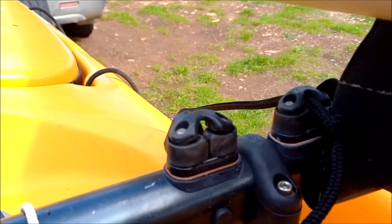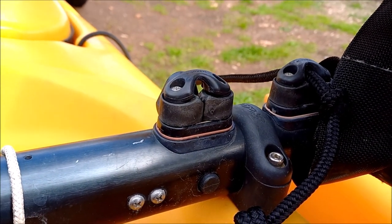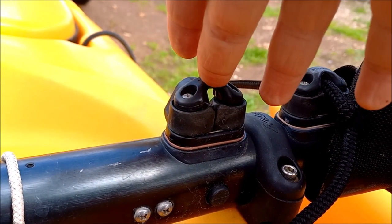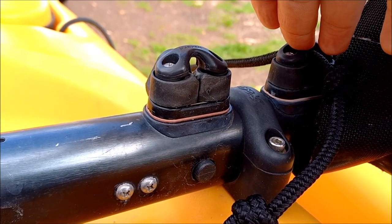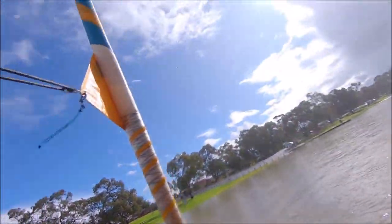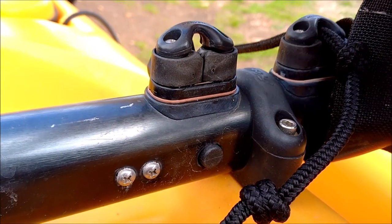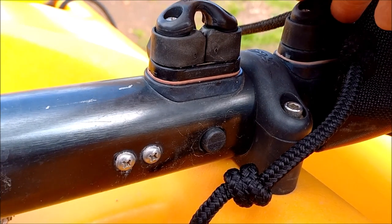These are the cleats of the boat — they just sit off to the right of the mast. The inside cleat is for the furling line, and it runs through there. The outside one with the black rope is the main sheet. The furling line reels the sail in — if you want to reduce its size, you pull on the furling line. If you want to pull the sail out or trim it, you use the main sheet.